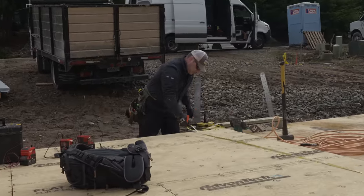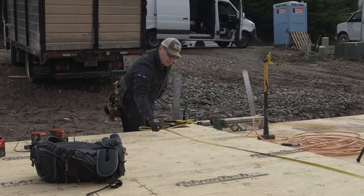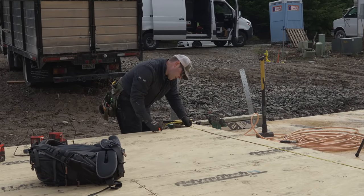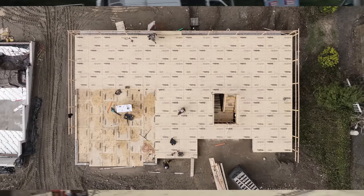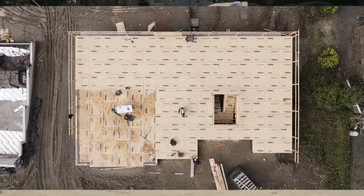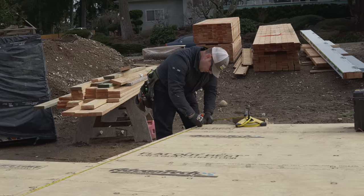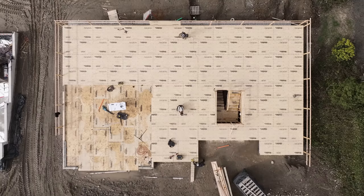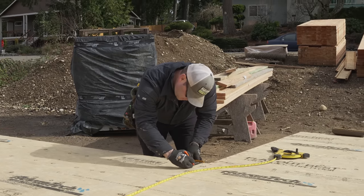Okay, at this point, I'm just gonna match what we have. Since we're hand cutting anyway. 37 foot 5 7/8. At this point, I don't care about the plan dimensions. I care about square and parallel and matching what we did with our mudsill. You good? 37, 5 7/8. 5.5, like right on the money. And then if you stay there, I'll get these next two and this guy. Okay.